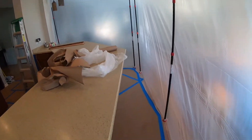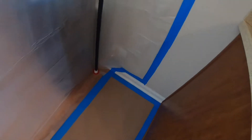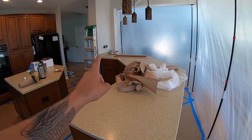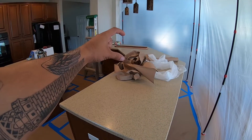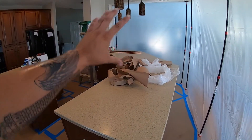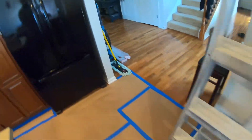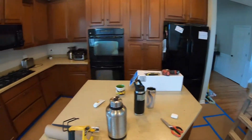Masking and surface prep is mostly done - done enough to move on to the next step. Let me show you what we've got going on. The dust wall is over here. We've got the floor protected - the plastic is sealed to the floor and then the paper is sealed to the plastic. The plastic is sealed up all the way around until over there. I haven't done that yet because I have to put some beadboard on the island and I need to get into that area - there's only about six inches. So I'll probably take the dust wall back a little bit, put that panel on, and then put it back up. Floor is all protected in here. I've got my zip walls ready to go around the corner. For this area I've had them up and down, but until I start making a big mess I'm going to leave it open - they're still somewhat using the kitchen.